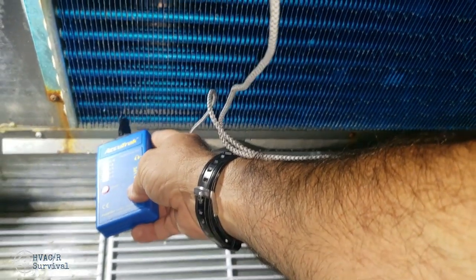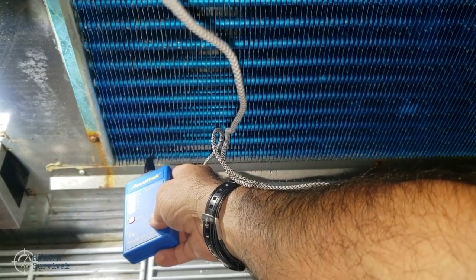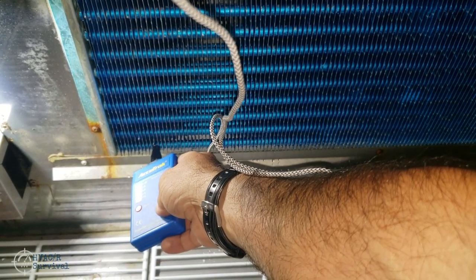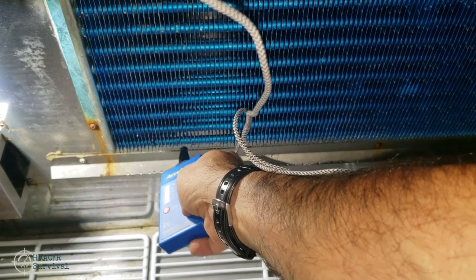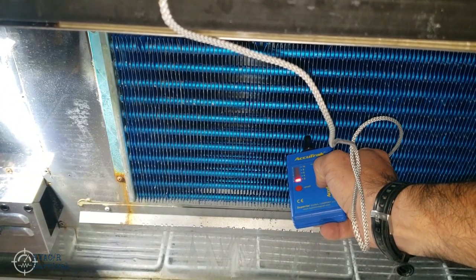This is another beer cooler where I had a hard time narrowing it down. Hear that ticking noise. I ended up finding there was a total of two or three leaks in this coil — literally just as fast as you can move it.